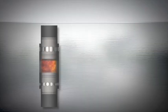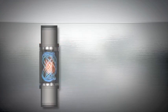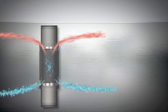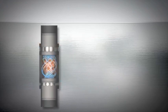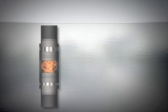The intake and exhaust ports are designed to optimize airflow scavenging. The exhaust ports are open first, allowing higher pressure exhaust gases to begin to exit. Once pressure has dropped, the intake ports are exposed and fresh air flows in while the remaining exhaust gases are pushed out. Both ports are closed off as the pistons move towards the center, and a small amount of residual exhaust gas is left behind.